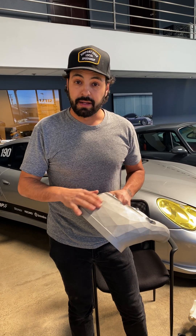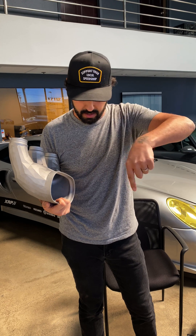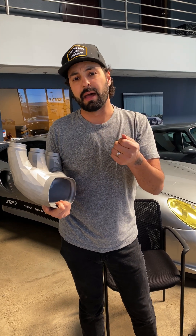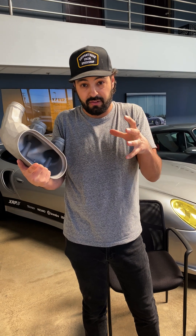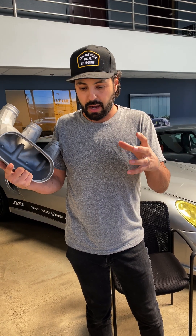Then you have the metal side of things. Back in the day they used to have a sintering process where metals printed out kind of like the traditional plastic ones. The metal was with a binder, like a wax-style binder, and you'd actually print it larger than it is. Then you take that end piece printed with metal filament and put it in a kiln, like you would with pottery. It would burn out all of the binding agents, and the whole part would shrink down to what you actually designed it to be.